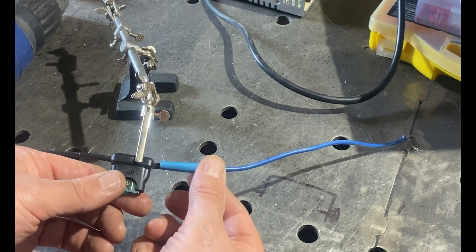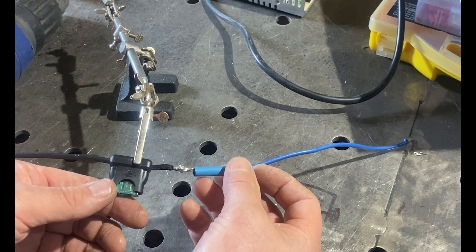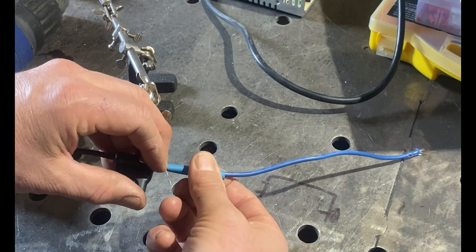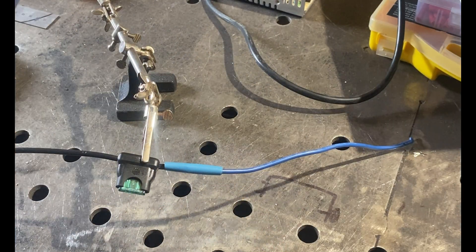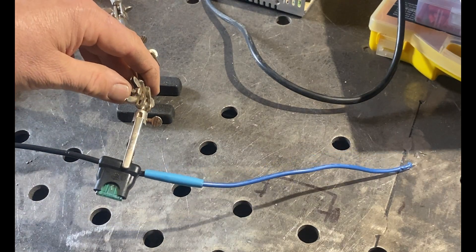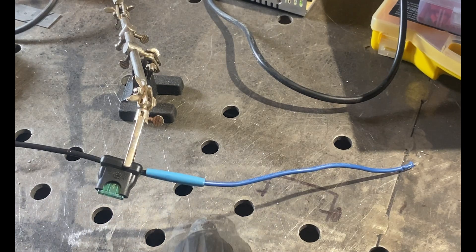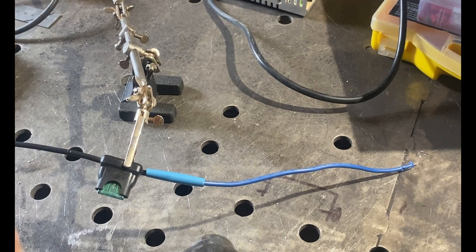I'm running heat shrink over the solder joints. Wherever we've stripped and tinned wires and joined them, we always place heat shrink over the top — we don't want anything bare that could cause trouble inside the box. We certainly don't want 240 volts contacting any parts of the box. You need to use extreme caution at the 240V, 120V, or 220V side when wiring those power supplies to make sure there are no bare wires near any metal elements.